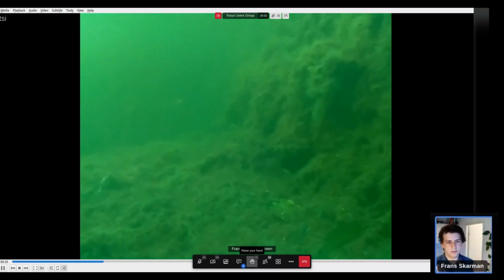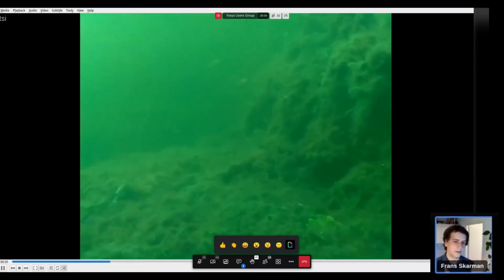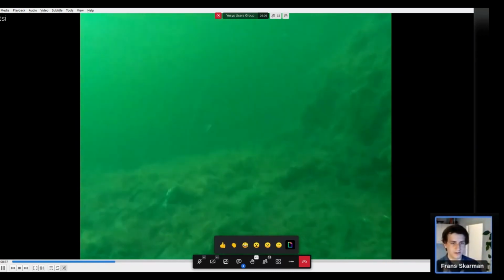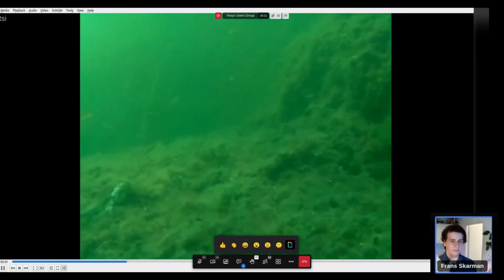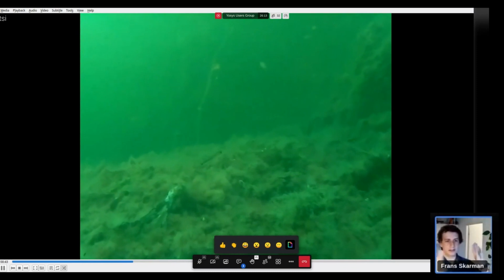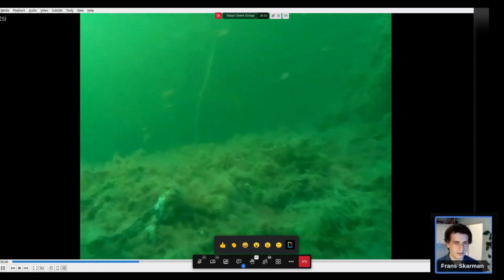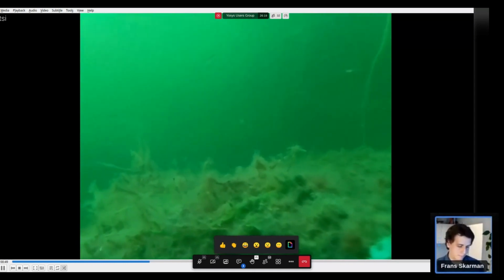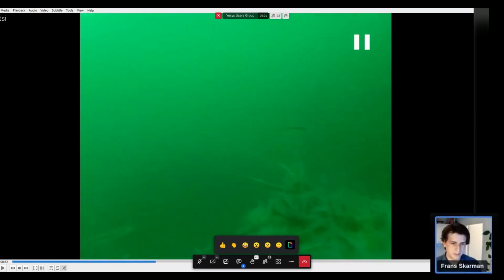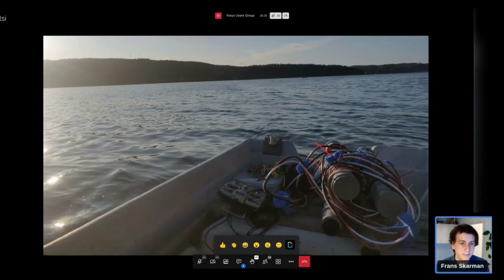So what I wanted to do was have a way to look around. Of course, a simple solution is to put a servo and have the camera tilt, but that's not fun. So my idea now is to have several cameras, probably 3, pointing in different directions, and then stitch everything together in gateware, I guess. And it's a fun excuse for an FPGA project and to play around with cameras. So going back to the slides,